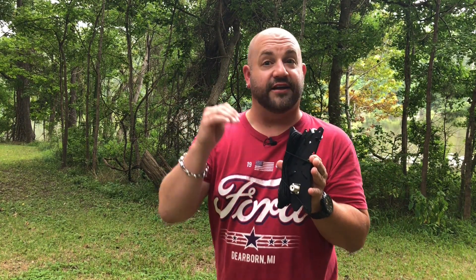There's a little catch — we're going to need a choke right at the feed point to make all of that happen. Without a choke, it's going to act just like every other End-Fed Half-Wave: we're going to get 40, 20, 15, and 10. But when we add the choke, I've actually found that I get 40, 30, 20, 17, 15, 12, and 10, all way under 2.1-to-1 SWR. And 30 meters isn't even advertised — in the instructions it says 30 meters is way high and crazy, but it's working for me.